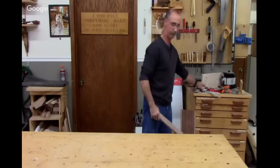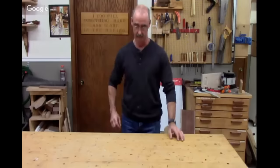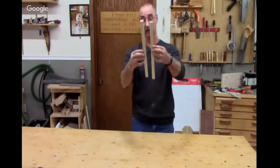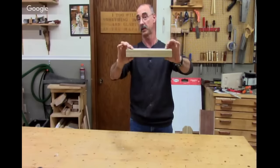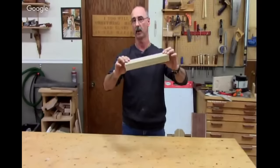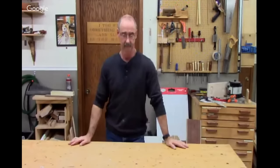John would like to know: when doing face-to-face glue-ups, can you force a board to be straight by putting two straight pieces in front and behind the damaged board? No, it's not a good idea. The Georgism I say pretty often is: excessive glue and clamp pressure cannot overcome bad joinery. If you do a face-to-face glue-up, you should be able to take those two pieces and with just finger pressure have them be seamless. Trying to force a sandwich to straighten a center board — eventually it's going to fail on you. That internal pressure you're creating is going to be a bad thing.